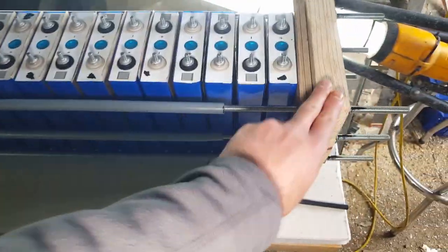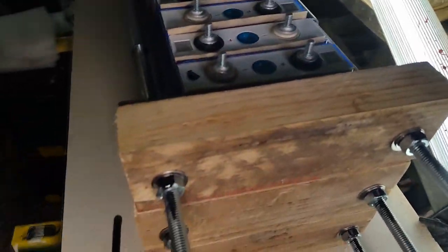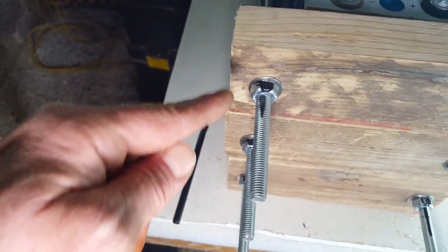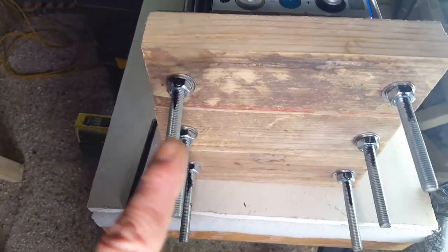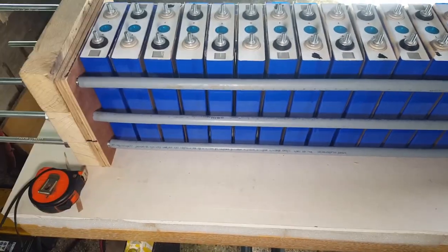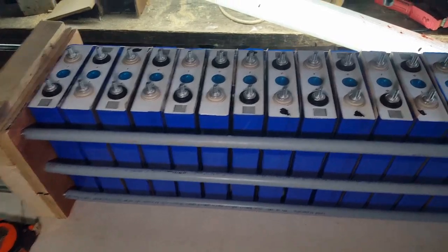I'm going to keep a very close eye on the burst caps — the pressure relief valves — as I'm winding it in. So that's it: two bookend clamps, the threaded rod, and twist the ends in. I've put timing marks and scribed a line on the nut so I can count the turns and spread it evenly — like a pizza, one cut at a time. I'll also measure between the clamps on both sides, top, middle, and bottom to keep them parallel so I don't go wonky.